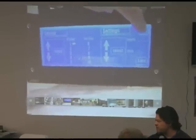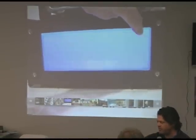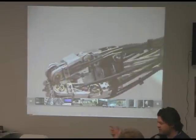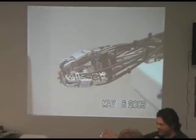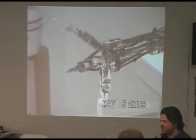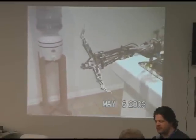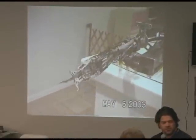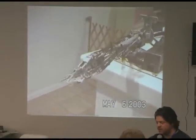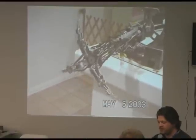Here's the touchscreen controller showing the editing software, with graphics showing the different stages of the fingers. You have the closed fingers, and here it's going to open up now. Touch the screen, and it immediately opens — it pops right open. Once it pops open, it goes back to live control and the radio controls go through the system via the stamps. This is just two channels on a radio controlling all six of these servos.